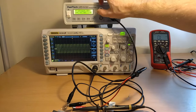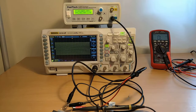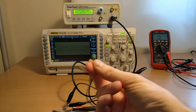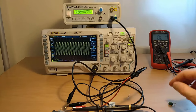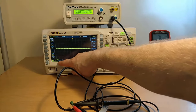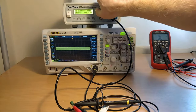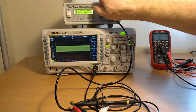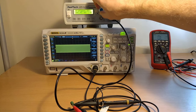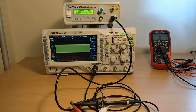Back up to 20 kilohertz again. Now let's try our tiny little inductor — the small one we found earlier that we couldn't get a reading from using our component tester. Because this has got a much smaller inductance than the other two, we're going to have to increase the frequency. As soon as I put that in circuit, it dropped the peak-to-peak voltage to 180 millivolts. That needs to be 1.54 volts, so let's start increasing the frequency. It's now 900 millivolts, 1.12 volts — looking for 1.54, which is about there, and that's at 600 kilohertz.